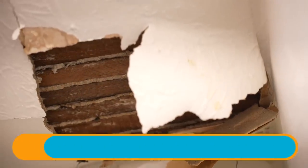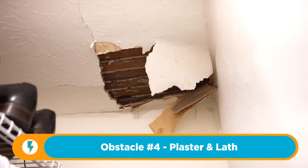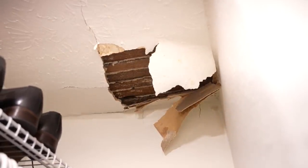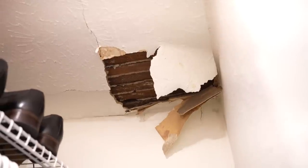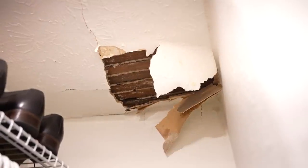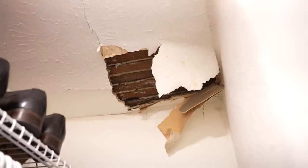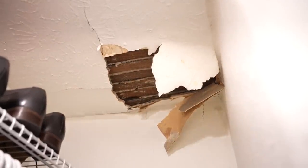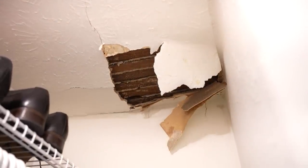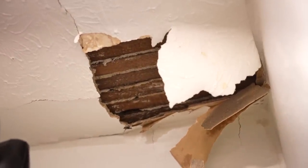The fourth category is plaster and lath, which is actually an entirely different construction than drywall. Rather than drilling into studs, lath is nailed across the studs and then plaster is smoothed over the whole surface. If this is the case, it is a lot tougher to find studs — you might have other metal objects like nails throughout, and it's often thicker as well. Not your standard half inch of drywall, but often about a quarter to half inch of lath and then another half to three-quarter inch of plaster, so there can be a lot of additional difficulty.